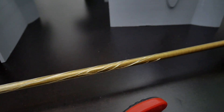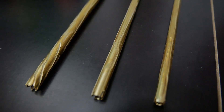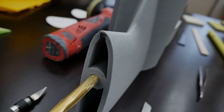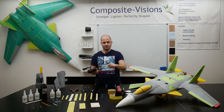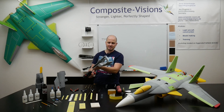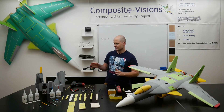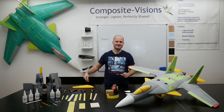Now let's talk about a very special tool — this electric drill with a brass tube customized on the top, with some cut-ins along it so it works a bit like a long drill. This is needed to remove the support in the connector holes. For example, here in the fuselage section for the 8mm main connector, you go easily in there, and while rotating, these little teeth remove the support. You press the support out as you go in until all the support is removed and it comes out. I have this in several sizes — for 8mm and 6mm — used for the fuselage and the wing, wherever you have long, deep holes where support has to be removed. Okay, that's it for the materials and tools — now let's start with the work.